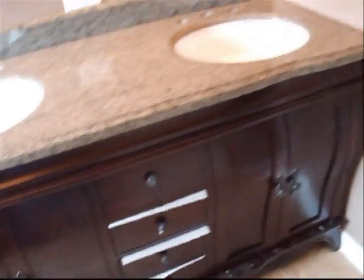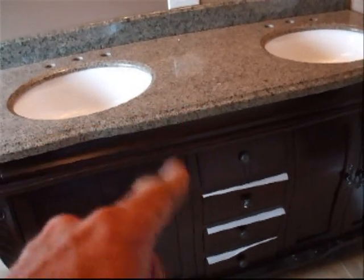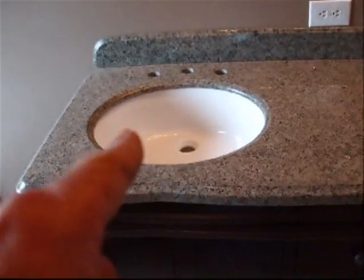We're finished with this bathroom. As you remember, there was that self-sticking parquet flooring. So what we did is put DuraRock on top of all that, nailed it down, and put this tile on. This is, I think, 20 by 12 tile, staggered. And a nice cool vanity — the homeowner actually brought it up and about killed both of us. It's all inclusive — the top came with the bottom, it's glued down. I'm going to be back later to plumb those sinks.